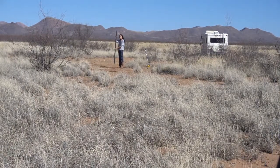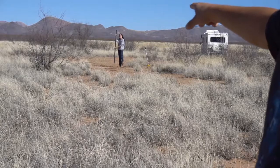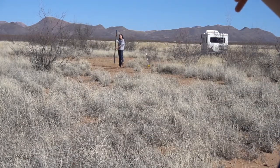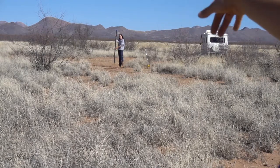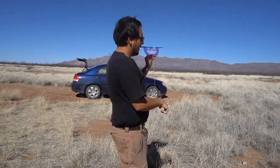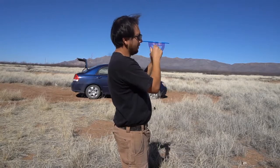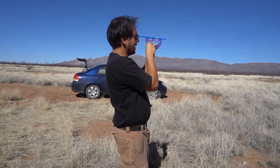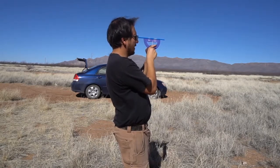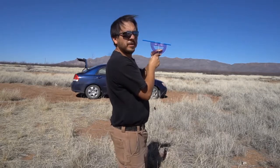I've marked out a spot 100 feet away and Jessica's out there now with our marked pole. I know the distance from where I'm measuring to where she is, which is 100 feet. I'm going to stand over here, and I know that the bar she has is 6 feet. I'm going to sight down there with the inclinometer, and when I have it sighted, I'm going to see where the string is at. We're at 93 degrees, which we'll want to keep note of for later when we do the calculations.